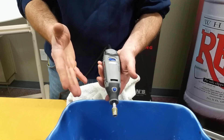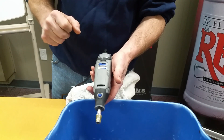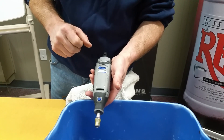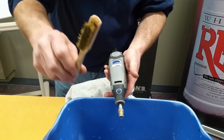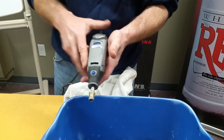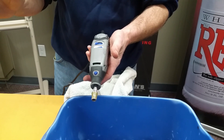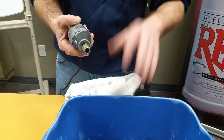I showed you this process, and you noted that the tool is not moving. We do not want the Dremel tool in the on position. If you do it in the on position, it will destroy your brush and it will not clean your tool very effectively — you don't want to do that. It's about a 20-second process to go ahead and clean this tool using this method.